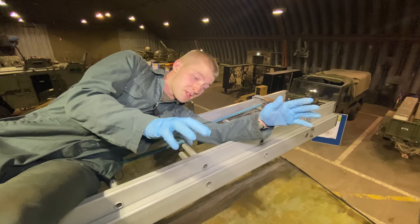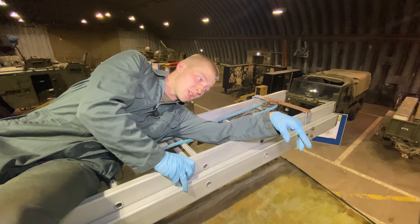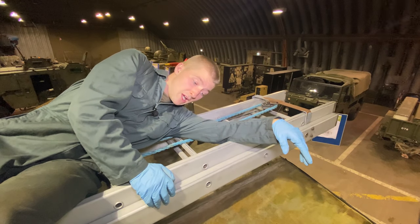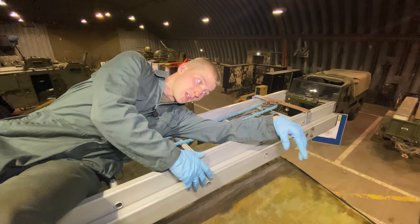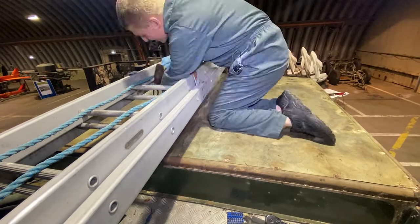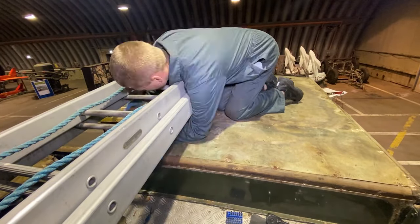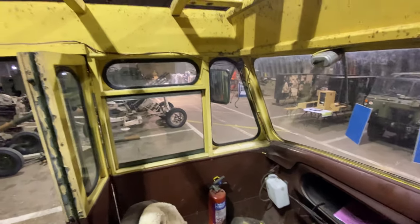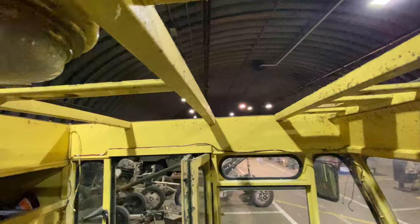The next step is pretty simple. The rest of the roof is held in just by nails into the wood underneath. What I'm going to do now is pry up all these nails, which are pretty much all rusted solid anyway, and then it's a matter of prying up the panels. Once we've removed the sheets of roofing we'll work along the more complex edges. It's taken over three weeks but we're finally at the stage where the roof is completely removed.